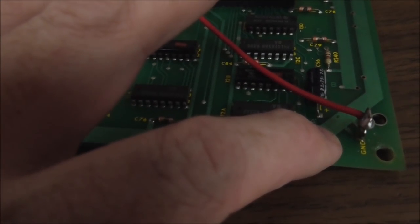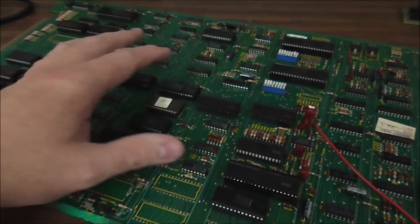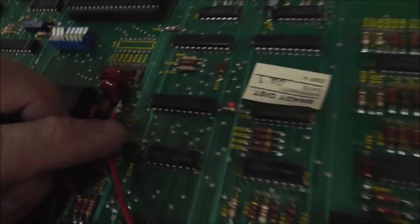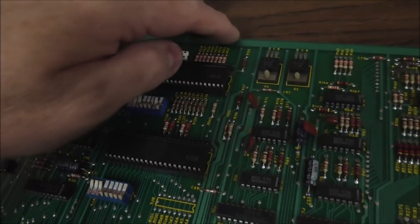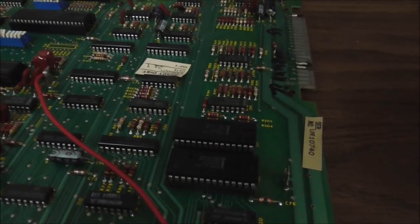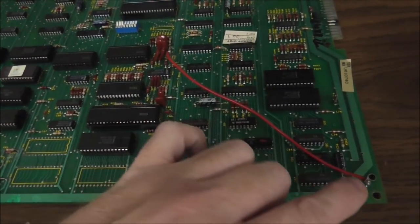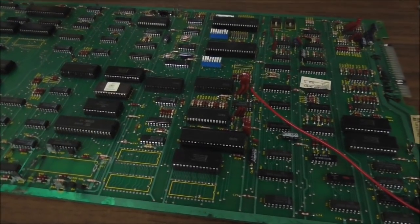For instance, this is a ground test point on a ground rail that goes all the way around the edge. But some chips in the middle have issues. There is a ground rail here — it's also a test point — and it's just on this short little ground rail that doesn't make it all the way to the edge. What people have figured out is that if you tie some of these test points together, it helps with your voltage distribution on the board. So that's an issue.